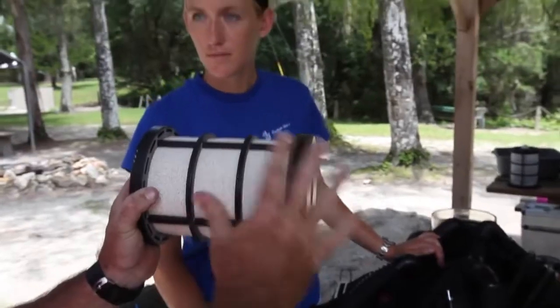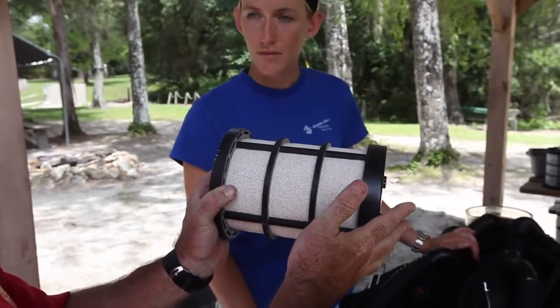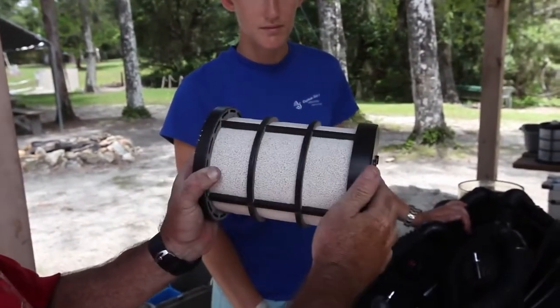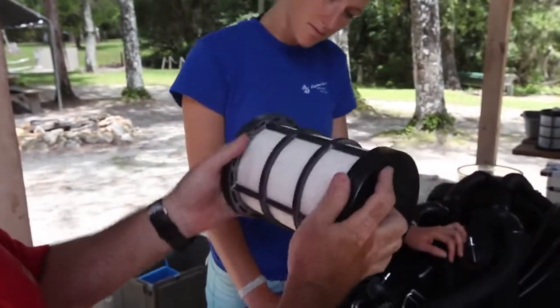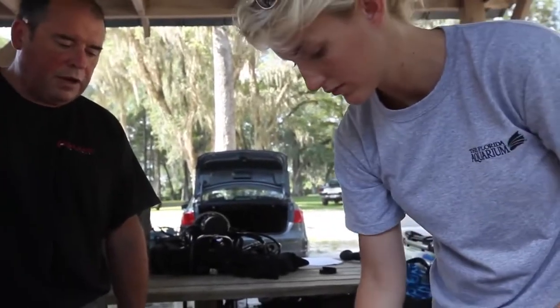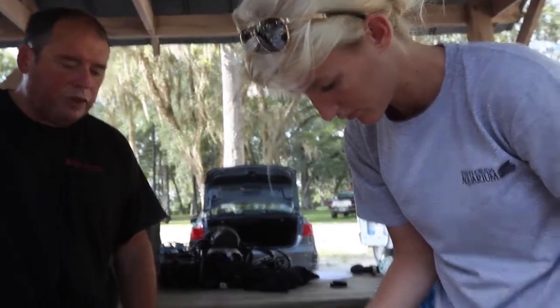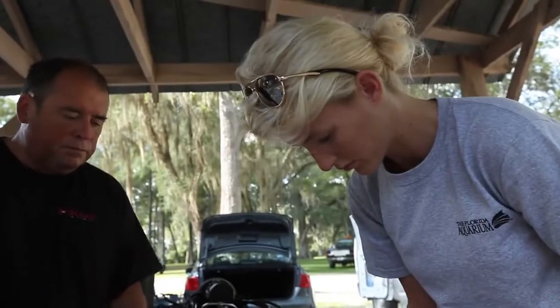Okay, once you've done it the third time and the cap is flush, you're then going to check the firmness of the pack to make sure that it's consistent and that the pack is firm all the way around. If that's the case, you're done. If it's not, then you're going to repeat the process one more time. Typically three times is enough. Sometimes a fourth time is needed. But you just have to check the firmness of the pack. Always check the firmness of the pack before you stop.